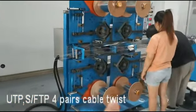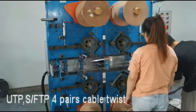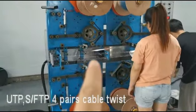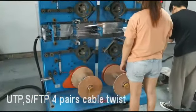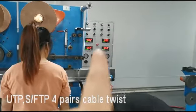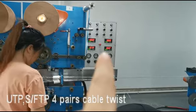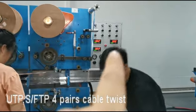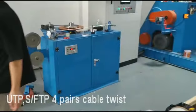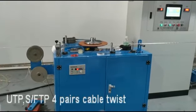This is taping — taping and packing. Each pair — four pairs — need to be wrapped in aluminum tape. It's very stable. You see these two, three, four pairs, to confirm the quality of the cable making. This is the off-site jacket taping.